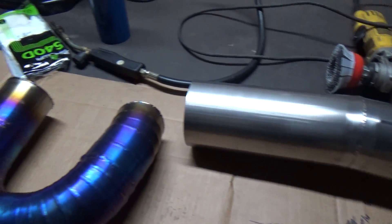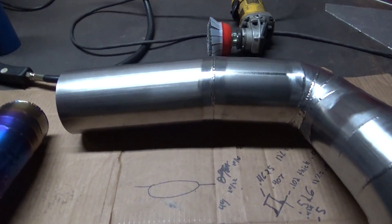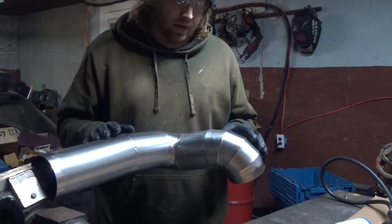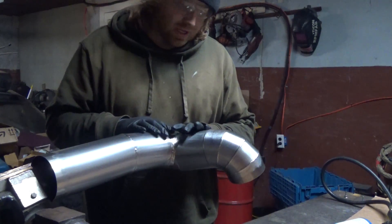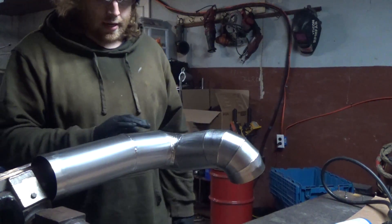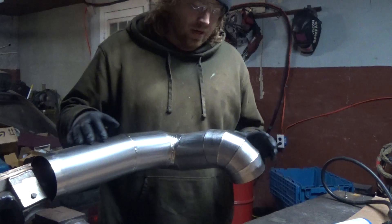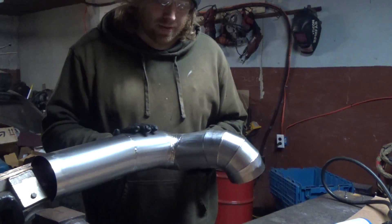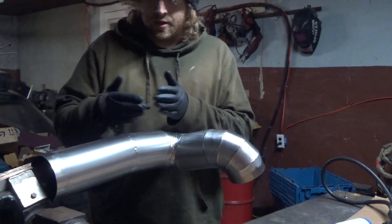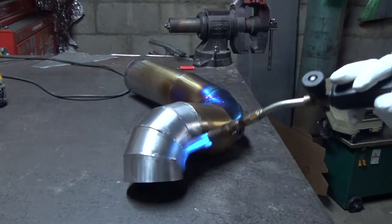It takes a little bit of time to get the heat into it, so while I'm heating the pipe I'm going to do a little voiceover talking about what I'm seeing and how I'm doing it. There are many different ways you can color your pipe. For me, I'm going to yellow the whole pipe and then where the welds are I'm going to try and get it to a nice blue. Down here it doesn't really matter — I'm going to be trimming this back and an air filter is going there. So I'm going to evenly heat the whole pipe to yellow, then focus in on the pie-cut sections and get them to a deeper blue.